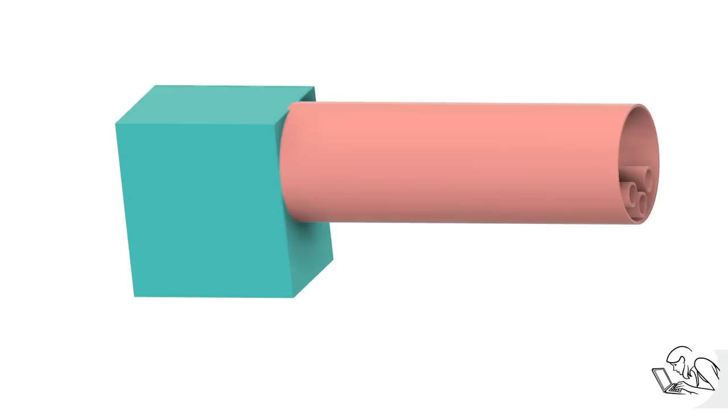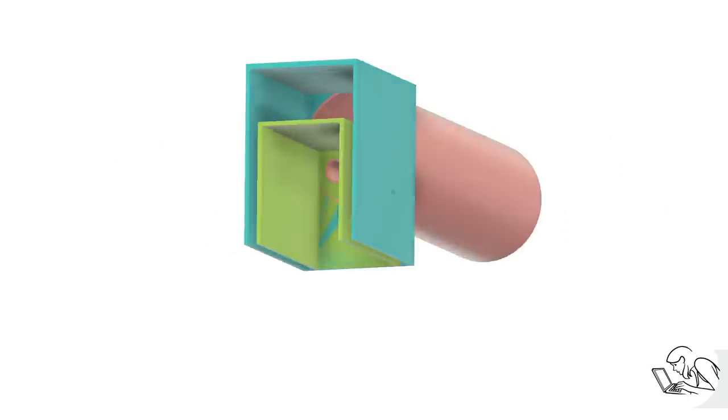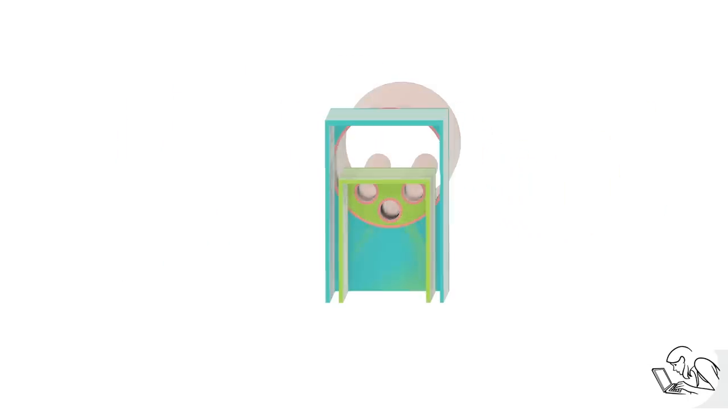So of course, the barrel at the front there is where all the water and the steam are. The bottom of it is water, and the top half is where the steam is sitting, ready to be fed out into the cylinders. And then the back here is the firebox, and this is essentially a double-walled box with the coal fire sitting in the middle of it and water all the way around it.